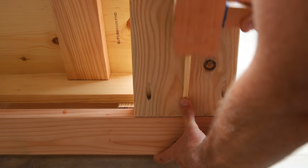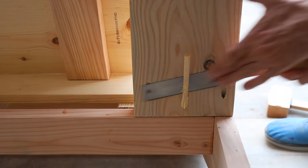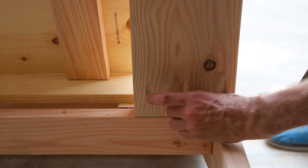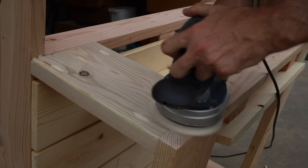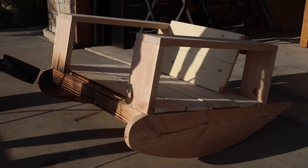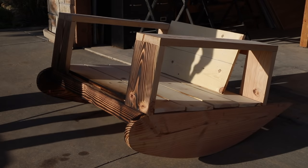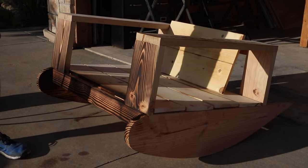There are several different ways to plug up pocket holes but my favorite is using 3/8 dowels, hammering them in place, cutting them flush with a flush trim saw, and then a quick sanding to get them smooth. I actually debated leaving this one the natural wood — that's certainly an option — but I couldn't help myself.